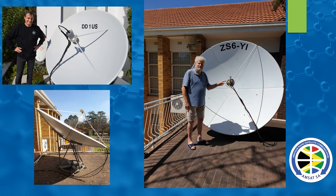This is the antenna used by DD1US, Matthias, who is the director of AMSAT. And then on the right is my dear friend Charlie, DK3ZL. Charlie spent a few days with me last year in February — he's quite a tall guy, well over two meters, and you can see the size of the dish in the background. He's pointing to a feed that I developed, which is quite novel. I actually use a laser to get that thing perfectly in line with the dish. On the left hand bottom is my 1.8 meter dish for narrowband, and the bigger dish for wideband — a solid prime focus dish that works very well.